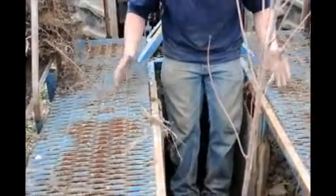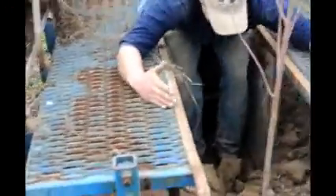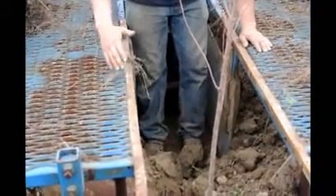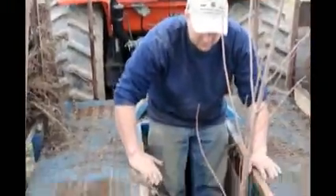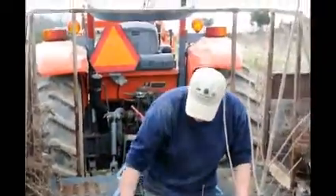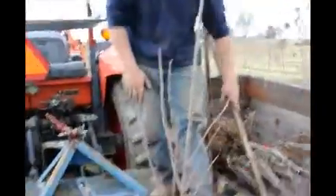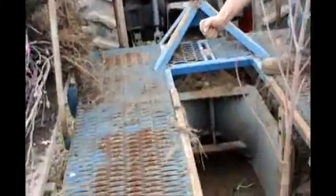As the soil is peeled away, it goes out to the sides, and as the tractor goes forward, these blades here come in contact with the soil peeled to the sides. Those blades then take that soil that was peeled out from the shoe and push it back over. We stand up here on these decks, grab our tree, put it into the shoe, and let the ground take it and get covered up.